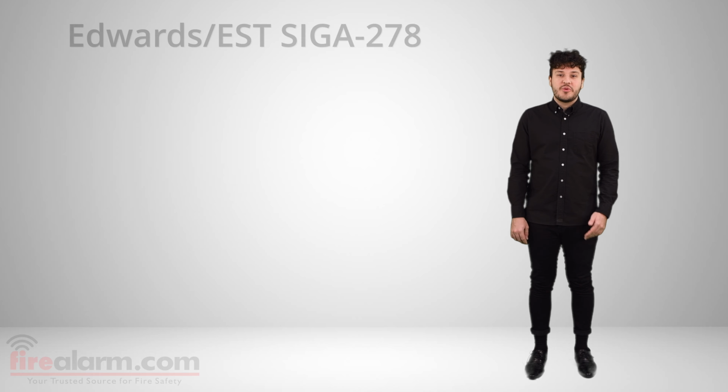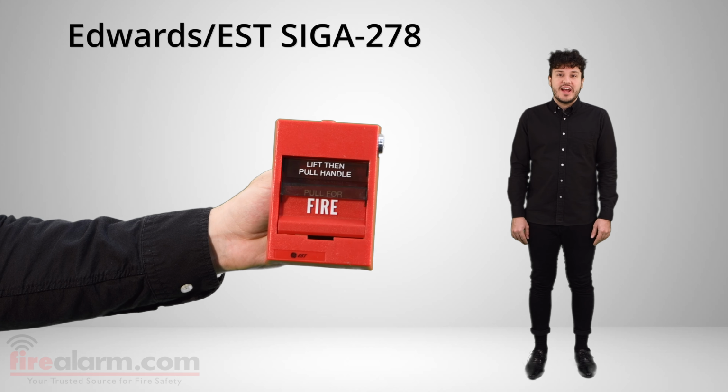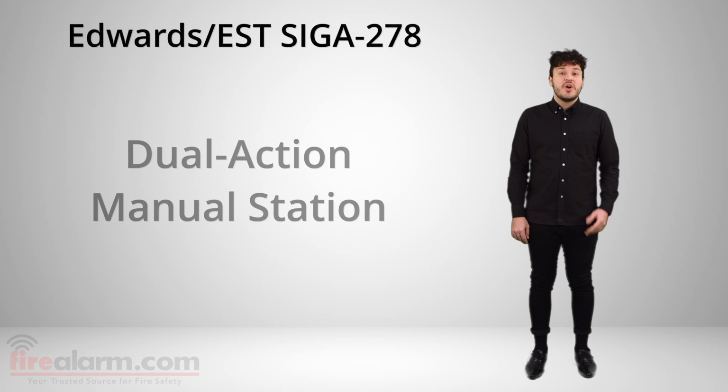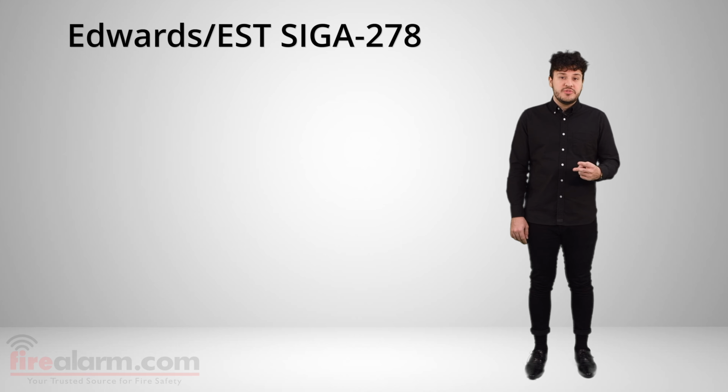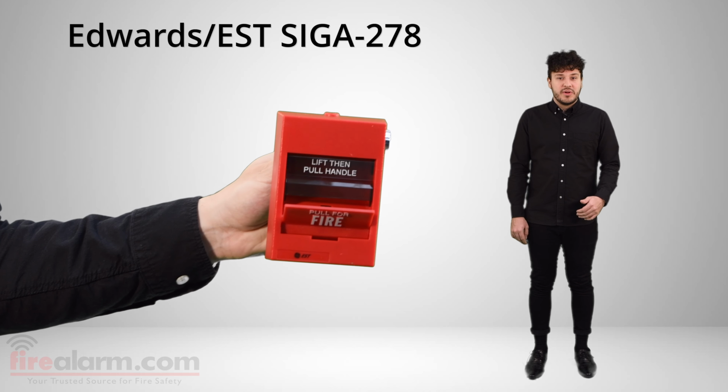Let's get into it. First up, we have the fairly common addressable Edwards or EST SIGA-278. This is what is referred to as a dual action manual station, which, as it implies, requires two separate actions to activate. The first being to lift this plastic panel, and the second being the actual pull.